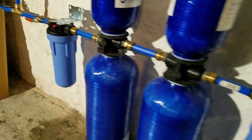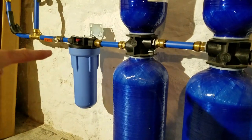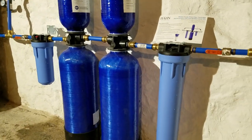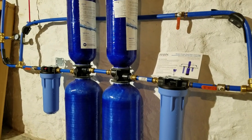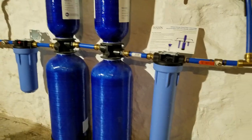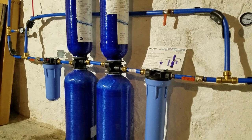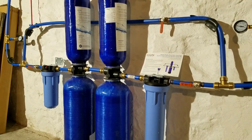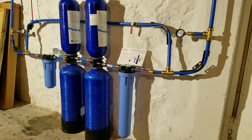Just so you're wondering: the pre-filter is about eight dollars a piece and the post-filters are about thirty dollars a piece, and these are changed about twice a year. The center tanks last anywhere between 300,000 and one million gallons and are replaced on roughly a five-to-six-year interval. Those tanks do run about eight hundred dollars. The softener tanks don't last forever — they clog up with contaminants — so keep that in mind.